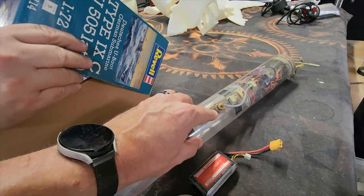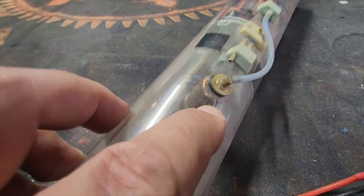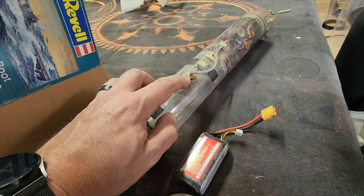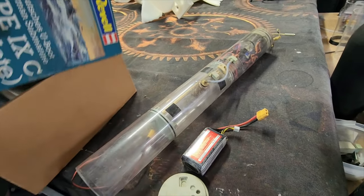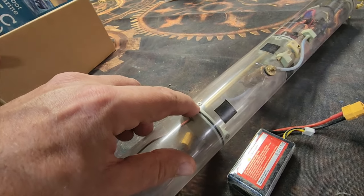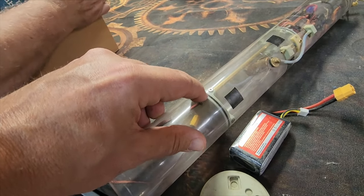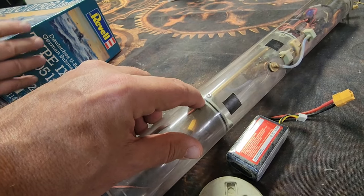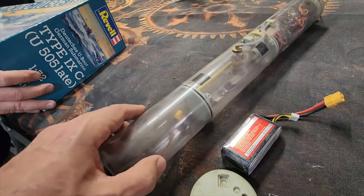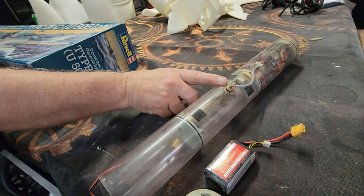These cracks are super common, by the way. Oh, the spider crack? Yeah, polycarbonate. If you don't stress relieve anything that you drill in it with heat, they'll stress crack. You'll see it with these all the time too, which is normally fine if they go this way because this is just a ballast tank. But if they go this way, it compromises the seal. So, not a good situation. This one looks good though. It's just around the top there. That's usually typical, especially if somebody's over-tightened it.